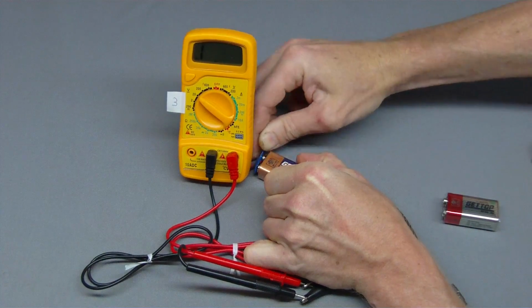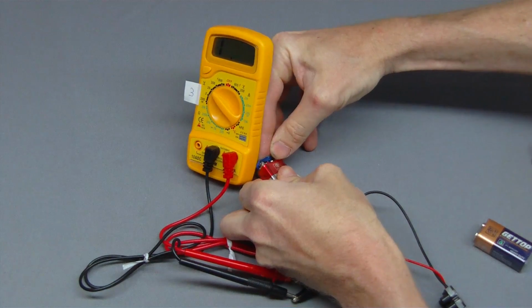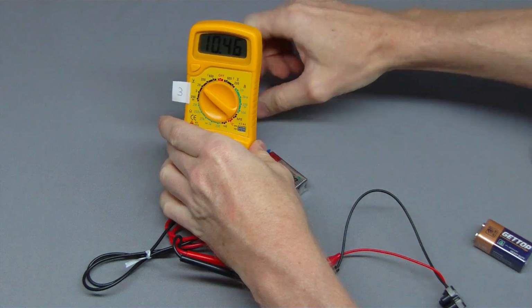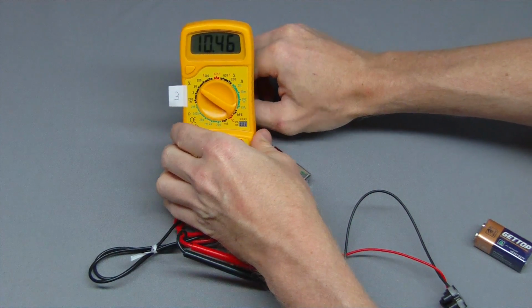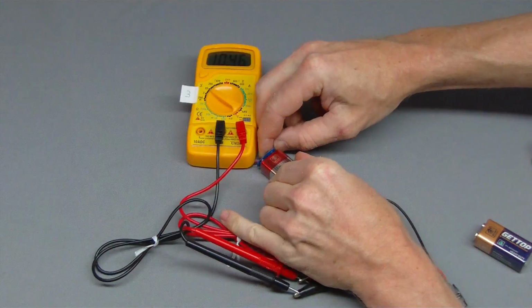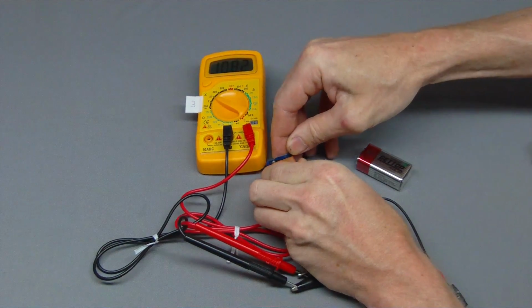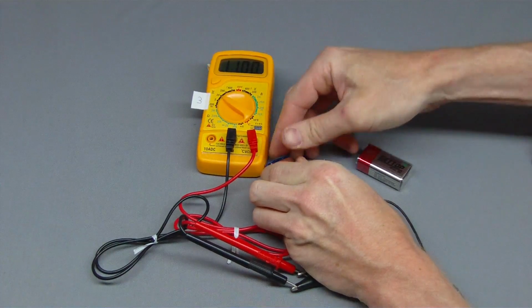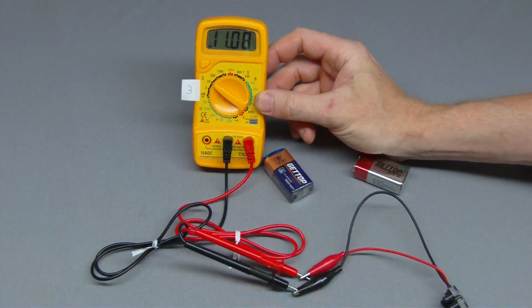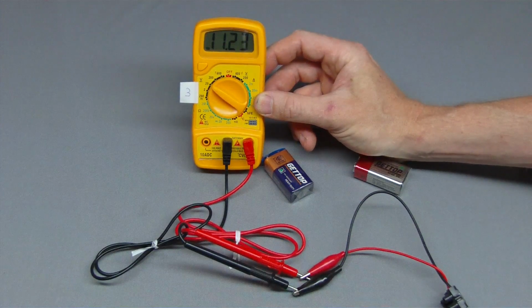While the old battery is connected to the multimeter, we can read 11.4 volt. And with the new battery connected to the instrument, the value drops down to just 10.4 volt. By reconnecting the old battery, the value rises up to 11.2 volt with increasing tendency. The remarkable deviation is indeed caused by the different voltage output of the battery. Quality multimeters feature a much better internal voltage regulation, hence the voltage output of the battery is a minor issue.